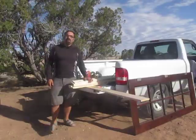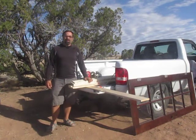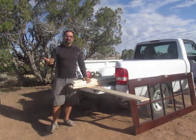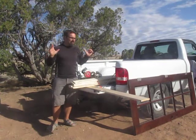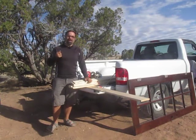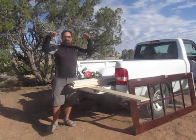The door is another thing I've been working on. One thing you may have noticed from other earthbag builders is that they use box frames for doors and windows — a box frame is just a placeholder that holds the rectangular shape of your door or window as you build earthbags around it, then you pull out the frame and install the door. I'm going to do it a little differently: I'm going to build the box frame and then actually install the door inside of the box frame. This allows me to check that the door or window stays operational as I'm pounding bags around the frame.